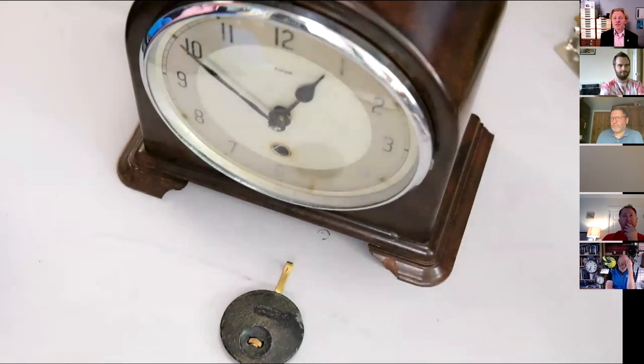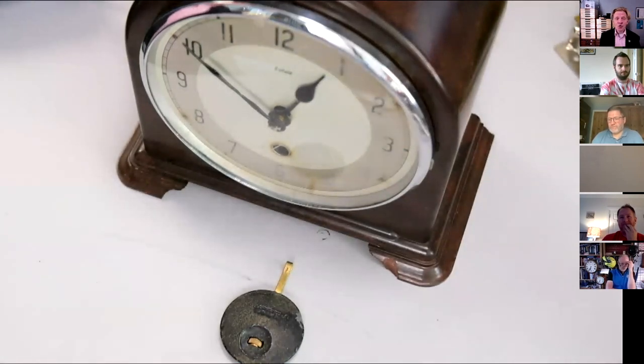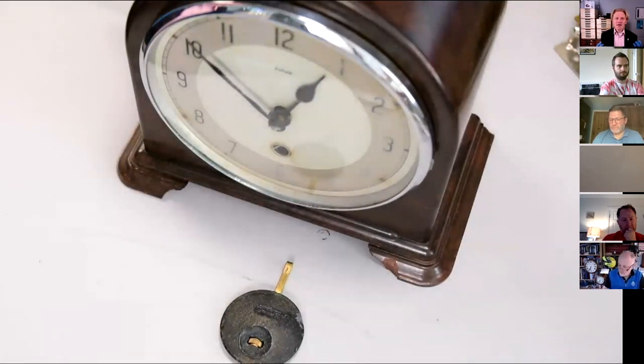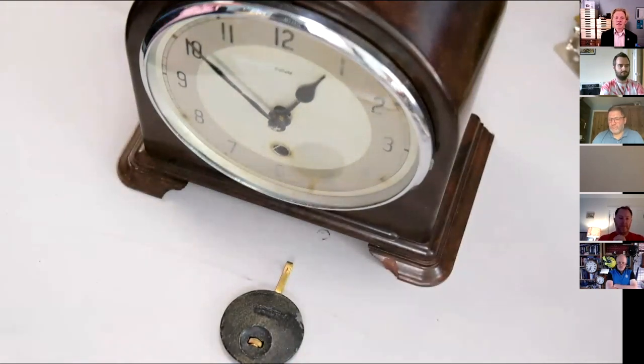Then we'll see in a bit, we've got some gears. We call this a gear train. Think of a gearbox in the car. Sometimes it's useful to have a bit of math, and we go through that in these sessions. But basically what the gears do is give the clock duration. Obviously, it's not convenient to wind it one minute, then have to wind it again in half an hour. It's useful if a clock runs for a day, typically a week, something like that. It also means that the indicator, in this case a pair of hands, goes round at some kind of meaningful rate. And that can be all sorts. You get clocks with moon, calendar, like this, the date, all sorts of different indications. And that is down to gearing.